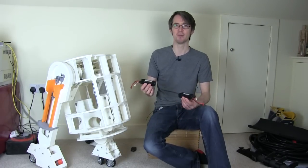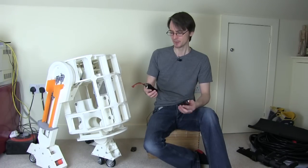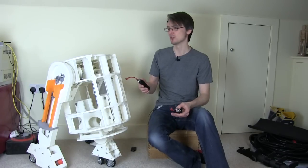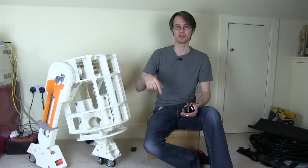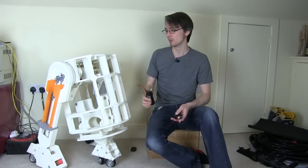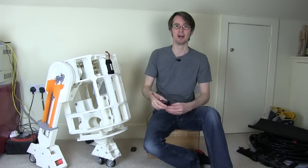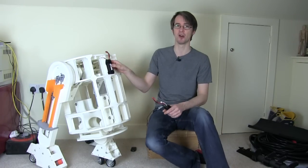You can get these up to 5 amp hour. I think it draws about 4 amps when it's really accelerating. The stall current of those motors is only 7 amps, and the conversion draws about 0.5 amp for those two tiny motors to winch the legs back and forth. So I'll probably have one battery in the body for the head spinning and the conversion, and one of these, or possibly some of these in parallel in the feet for long-term driving.